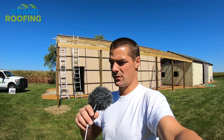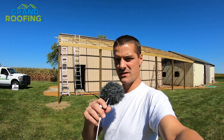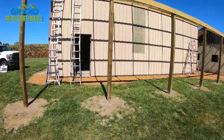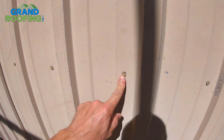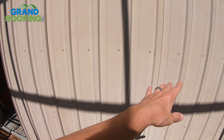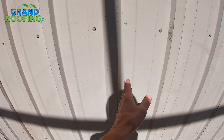You're going to need to know if you're doing exposed fastener or standing seam — hidden fastener. I'll show you the difference between those. This one is going with exposed fastener because it's a closer profile to what's up on the upper part of the original barn. Exposed fastener — it's exactly that, exposed fasteners. You can see a hook here, there's where two panels lap. It's a five-rib exposed fastener. The profile is different — we're not able to find this one any longer. We're still going with a five-rib exposed fastener because they all should wrap up the same distance.